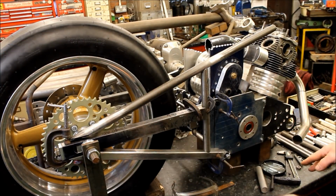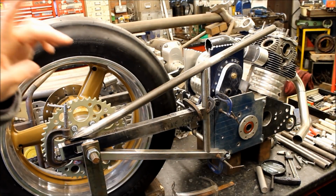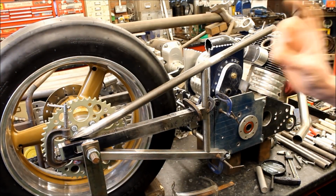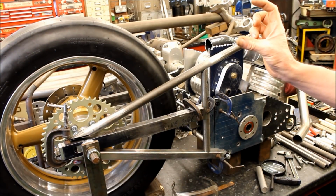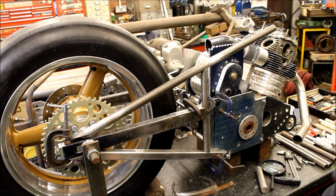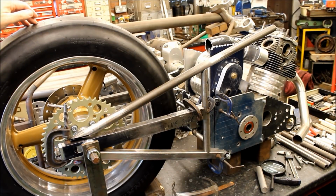Okay, and now that wheel's gone, and you've fitted a 17-inch wheel. The reason being that you can no longer buy the 18-inch tyres, it's not available. Well, you can get 18s, but they're not the original slicks like they used to do. They don't make them anymore. Okay, but they do make 17s. Yeah. So here we've got a 26 by 17. You can read it on there. And what you found, it seems, is that this tyre is a hell of a lot taller than the original.